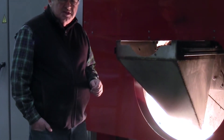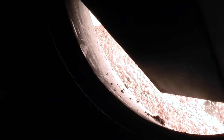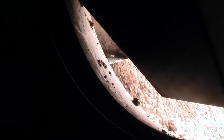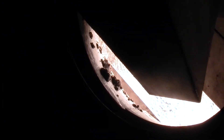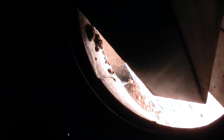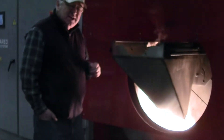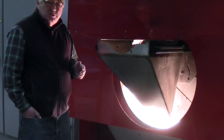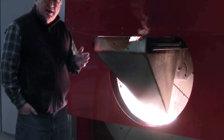I'm standing on the north side of the system — this is the input side. The Ellsworth centrifuges have delivered us 20% dry cake and we have put it into the system and started the drying process. The infrared heaters are hitting the product at 212 degrees and taking water out of the product. The drum is slowly moving and breaking up the product as it moves through the system. We're just now in about the fourth minute; we still need to dry for approximately another 20 minutes to eliminate all the pathogens and dry the product to 90% dry.